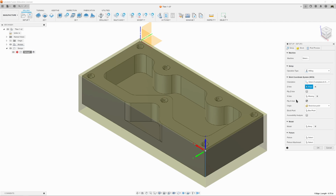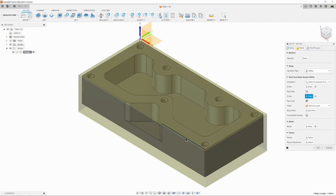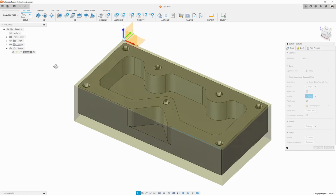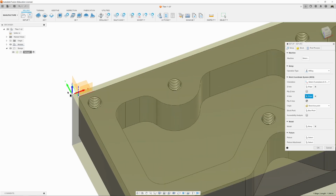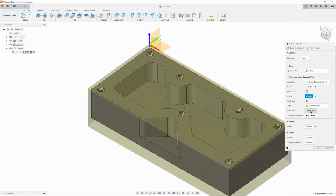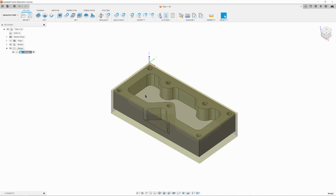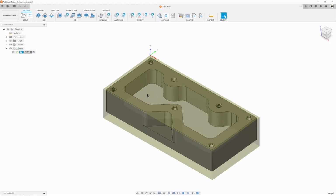We deleted the chamfered edge, so it's going, hey, I don't have something. What do I do? So we're just going to clear it. We're going to then select it again. And now it recognizes it. And it's all back to normal, back up here. And if it wasn't back up there, we could just do what we did with the box point. And we'll hit OK. So just remember, when you change things, it affects other things.